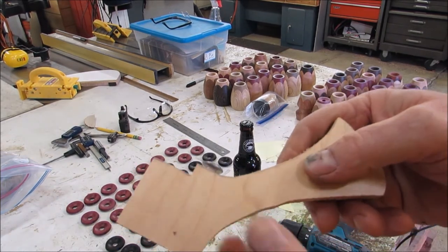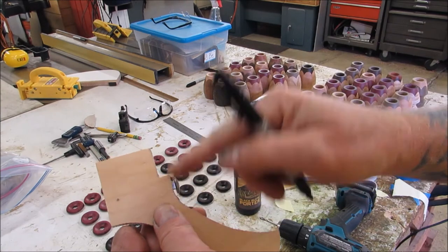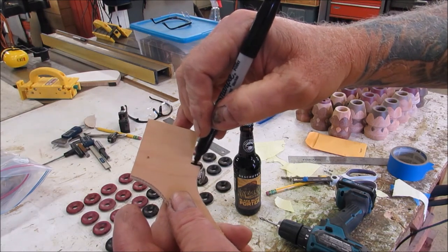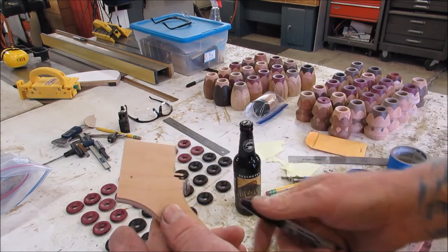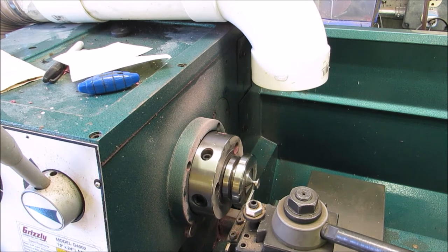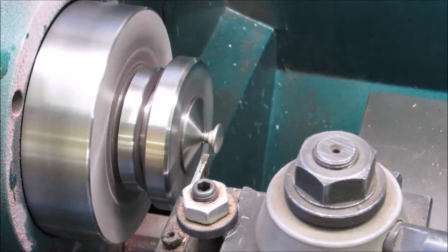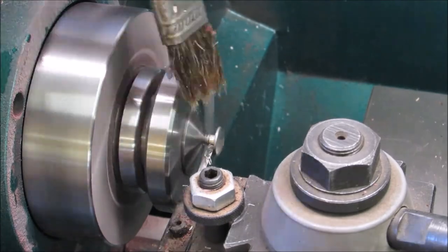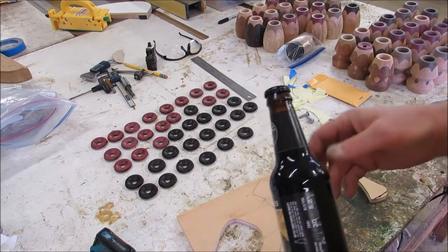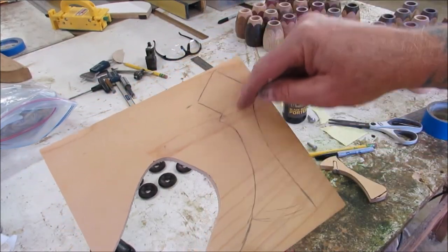This is what I was talking about in the design: if I leave that shoulder it's going to stick up and look funny. I got the hole in the head too far in, but that's why I'm making a prototype — so I can figure these things out. I know I've got to trim that back a little bit and I'll take the shoulder off that bolt so it can drop down. I'll grab onto that bolt with a quarter-inch 5C collet and go turn that little square shoulder off.